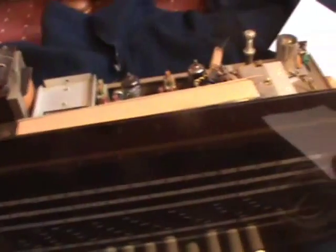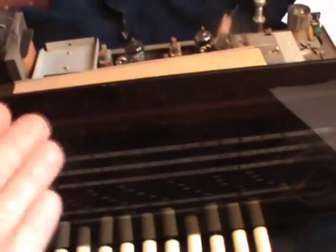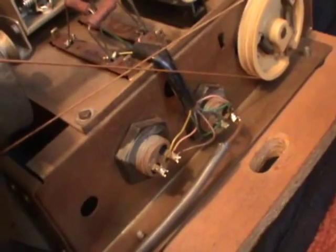We don't have a power supply for this — there's no PSU. The PSU must have been somewhere in the cabinet and we didn't get that. But I have sussed out that these are double capacitors here going underneath, and we sussed out where the HT wants to go. So I'll be using these two caps for now. I know you can buy them all, but I believe we can make our amplifier by using all the parts from this, all being well, until we get it all up and rolling.